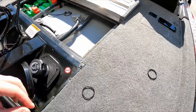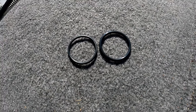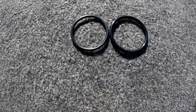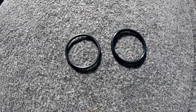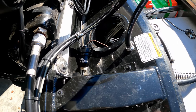So what I did was, I went down to O'Reilly's, and this one's almost the same diameter — it's just a smidge bigger, but it goes on pretty tight. However, it's quite a bit thicker though — it's a little bit beefier O-ring. We're going to go ahead and loop that bad boy up, put the old cartridge back in, drop the boat in the lake, flick that livewell on, and see if it holds. So that's the plan — let's go ahead and try that out.